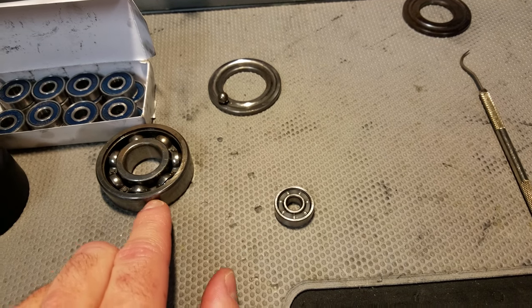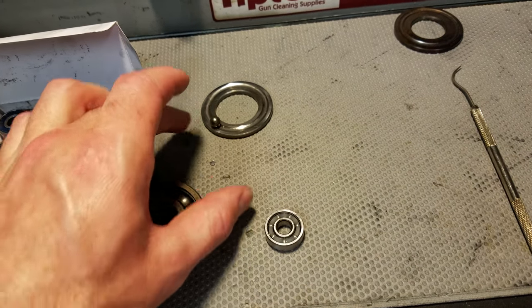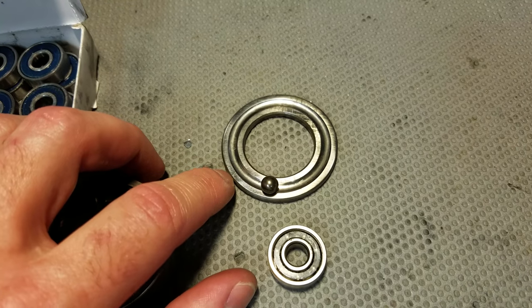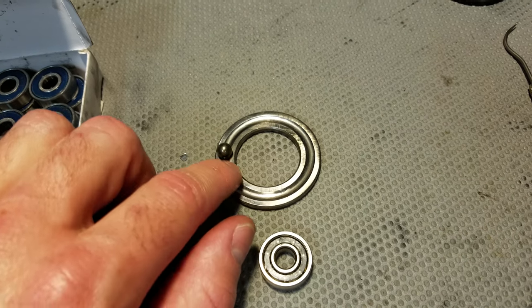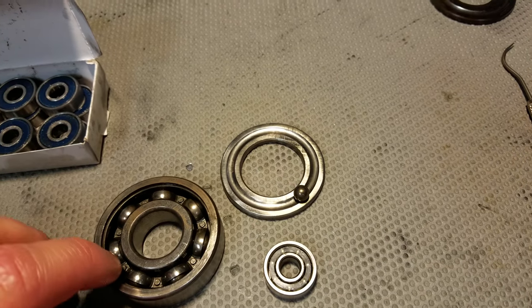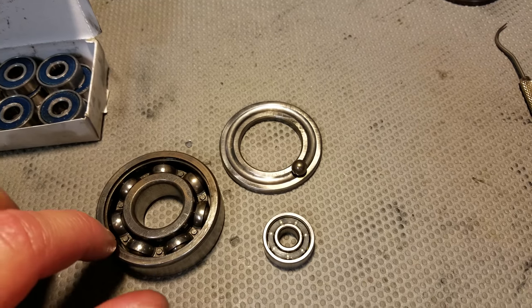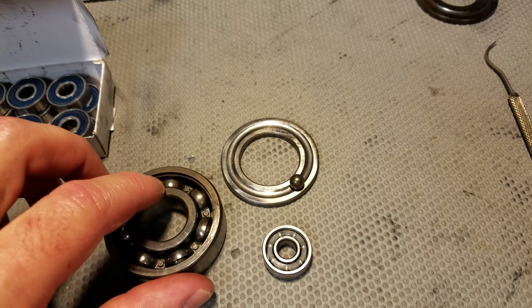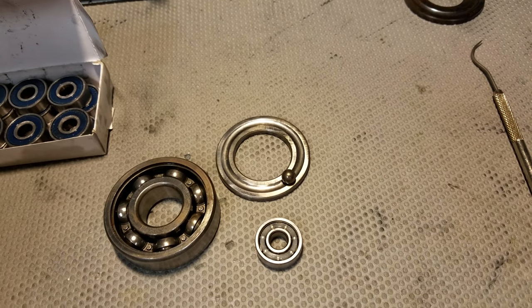You'll have less friction with the synthetic material rubbing against the steel balls versus steel on steel. Also, this right here is a different type of bearing, but you'll notice this groove that runs around the ring — the ball actually rotates in that groove. That's called the race. There are two races: an inner race on the inside of the inner ring and an outer race on the inside of the outer ring. The balls are actually riding in these two corresponding races — it's machined very smooth.